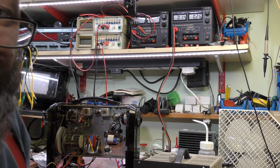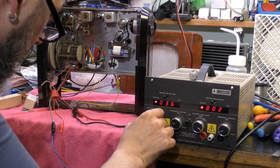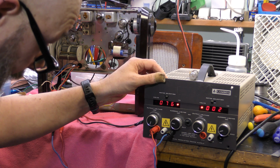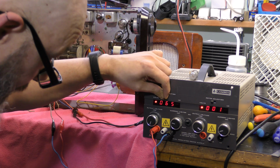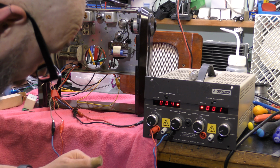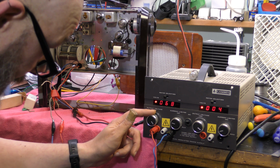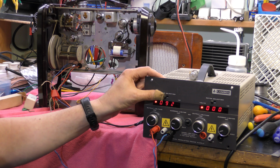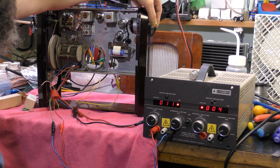So I'm now ready to start bringing the HT up. Alright, I'm going to wind the HT up. Oh, that's good news. 50 volts. Current. It's a bit intermittent, I think, on here. So it's 4 milliamps at 50 volts, that's good. Keep winding up. Oh yes. That's very promising. Right, there we go. About 11 milliamps, that sounds good to me.